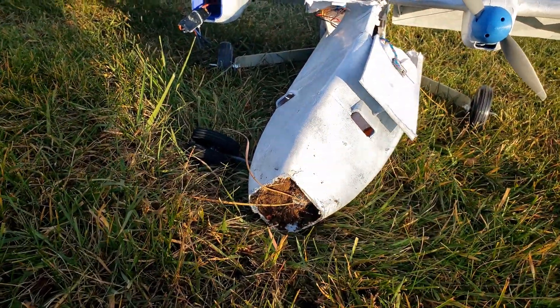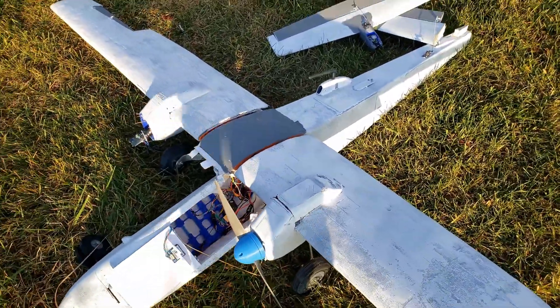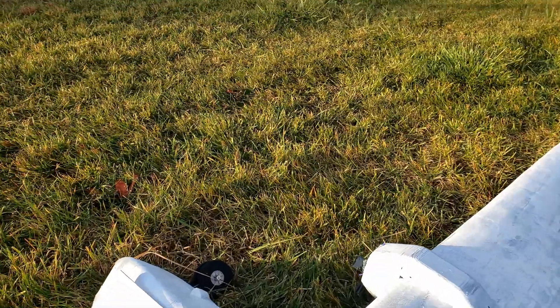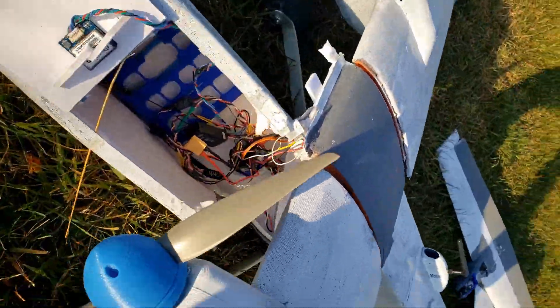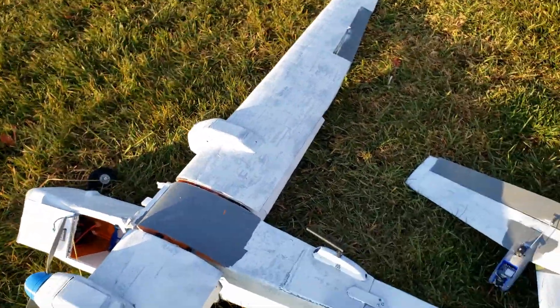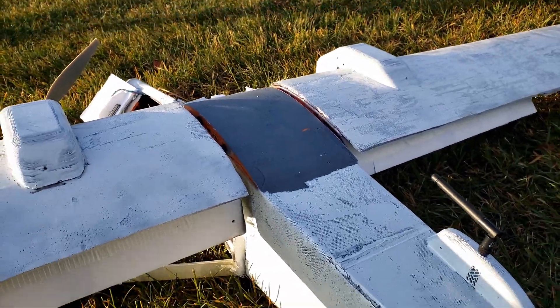This time I'm probably not going to attempt to repair it. I think I'm just going to restart from scratch. I'll change a few of the designs because I found some stuff I don't really like — like the connector and the wings — and I'll probably redo the motor mounts after this failure. I think I'm going to 3D print them in a different layer orientation and then make a mold to apply fiberglass to the outside.